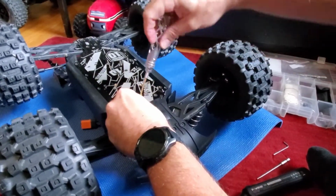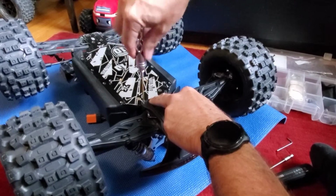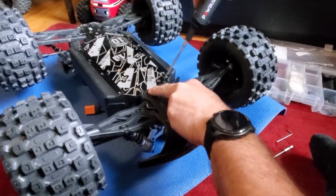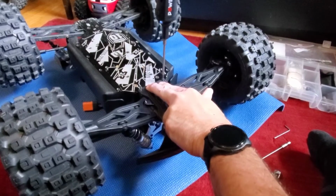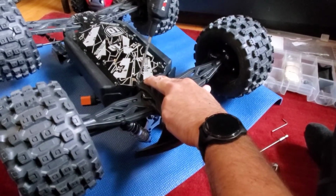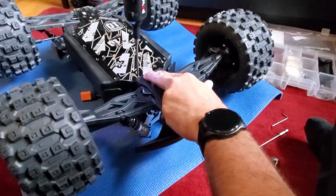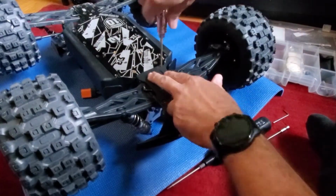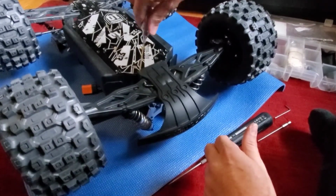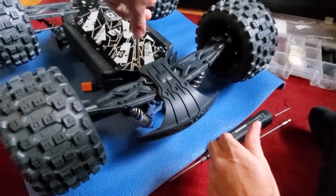It's already there. Still, again, I like to do everything by hand to get it started. Make sure, and in metal here, you can also strip the thread. So go with the electric driver, 2 millimeter. Make sure we're good. Okay, don't want to overdo it. All right, finish her off with the last little bit hand tightening. Making sure we're snug, but not over tightened. All right, that's good. And that's it.